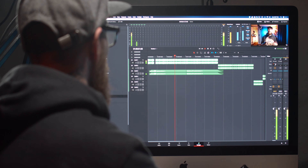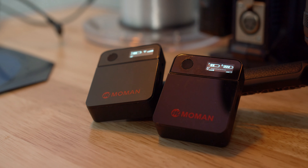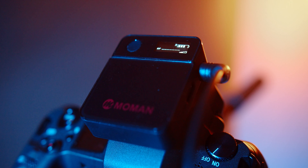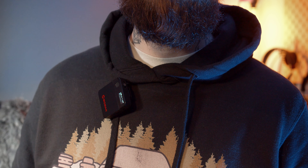You can set the decibels at different levels on the preamps on the receiver and that will help, but I have noticed the floor noise is a little bit high. This can obviously be corrected in post, and I do recommend doing your own testing if you pick this product up — finding what decibel you want it set at on the receiver and what volume you want your camera to be. It's a balancing act figuring that out. Final thoughts: for the quality and what you're getting inside this bundle, I highly recommend checking this microphone out. It's a really good alternative to others on the market. I will have a link for it in the description below if you guys want to check it out.